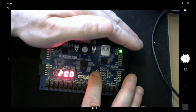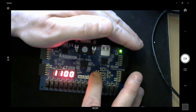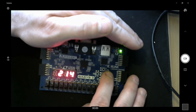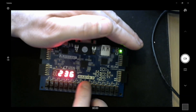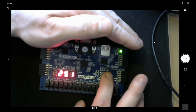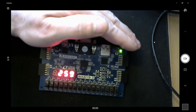Pressing reset starts us at 12. Pressing the increment hours button skips forward — you have to push and release quickly — but you can see it incrementing. Here are the minutes incrementing as well. The important thing to verify is that seconds correctly increments minutes, and minutes correctly increments hours, with all hour values correct.